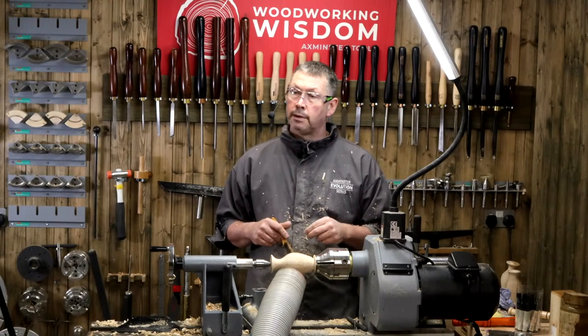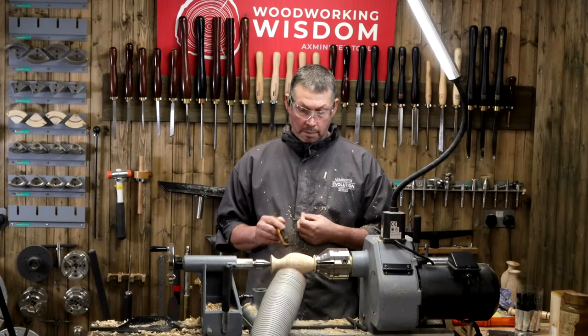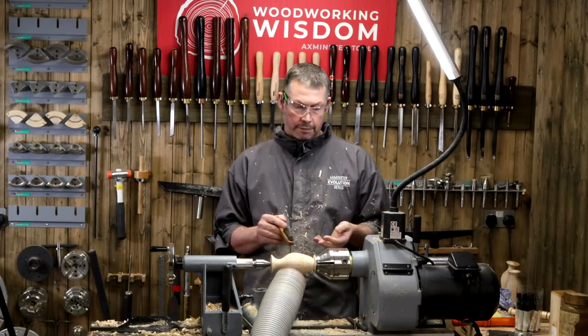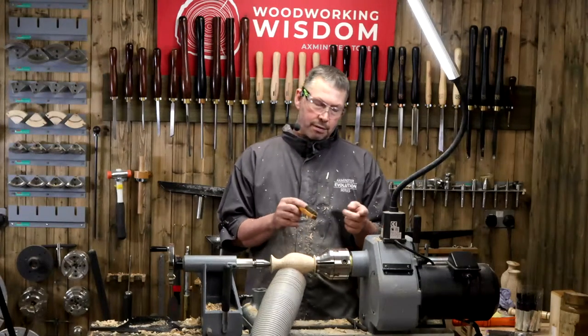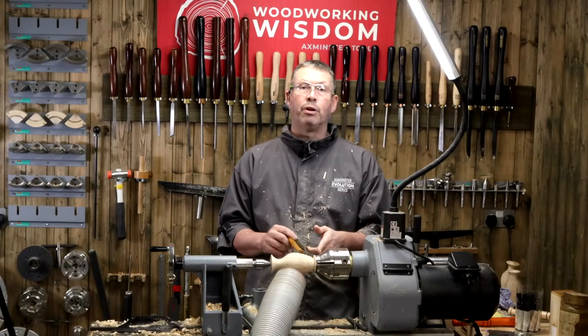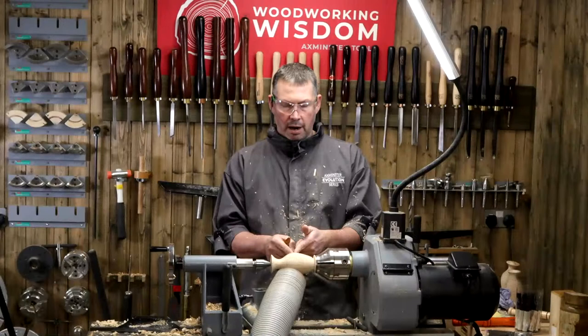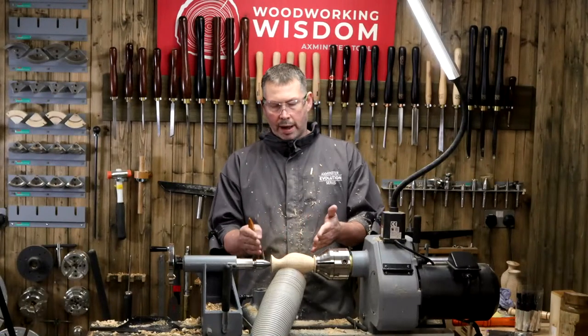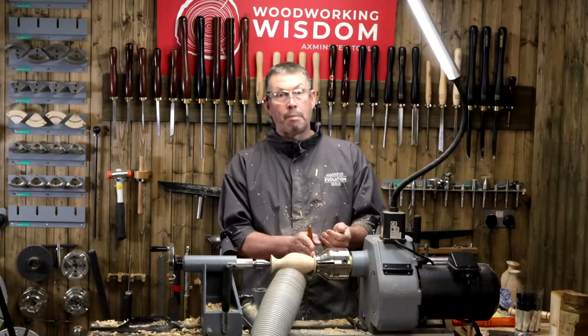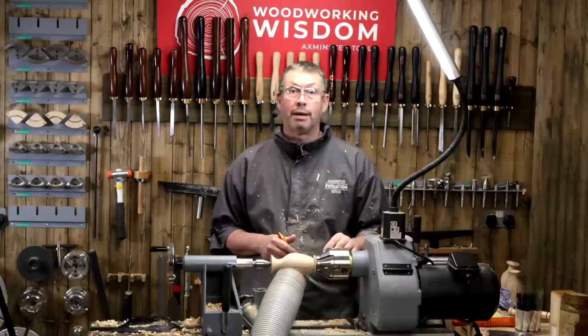And then Scott's asking, please can you explain why you started the beading at the widest part versus ensuring you have a full bead at the rim? It's easier for me to end on that full bead by cutting with the parting tool, because whatever happens, you're going to have a half bead at one end. So by starting here, nice and easy, I can then work my way out around the top over and just trim back to my last full bead. Makes it easier for me. I don't have to worry about anything.